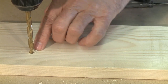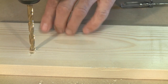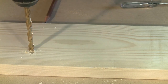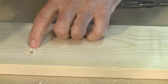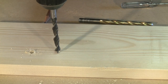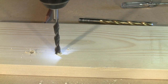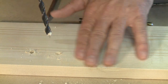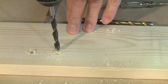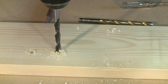If the bit doesn't go in exactly where you want and you decide you want to make another cut, when you use a twist bit the problem is it's very hard to make another cut because it wants to slide into the hole. That's why we like using a brad point — it digs right in, it won't move around. And the nice thing with this is if you want to drill another hole right beside, this is a much better bit to do that, because as you put the bit in it won't slide into the other hole.